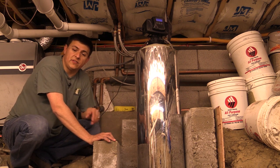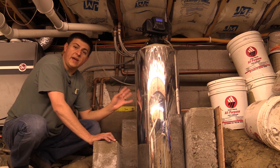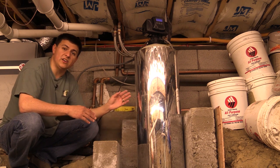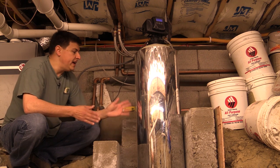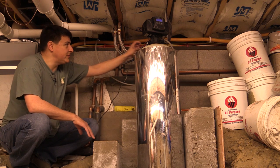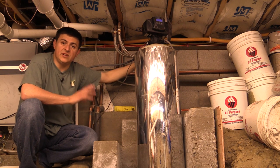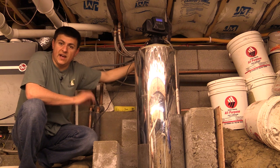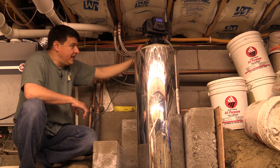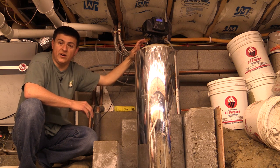However, it doesn't really do anything for calcium removal or extra iron removal for washing whites. That's where we have a water softener. We're on well water with a high iron and calcium content, and we wanted to deliver a good shower experience, so we decided to oversize our water softener. We found this one online — I believe it was watersofteners.com — and it's much larger and offers much better flow characteristics than the ones you'll find at Sears, Home Depot, or Lowe's. This one uses one-inch plumbing connections, whereas a lot of those units use either half-inch or three-quarter-inch connections. Water softeners don't just remove calcium — they trade calcium for something else, either sodium or potassium. You put salt or potassium pellets in the outside tank, and that flushes the resin bed to get the calcium out. It's really just an ion exchange process. It also tends to accept iron, so iron comes out in that same process along with the calcium.